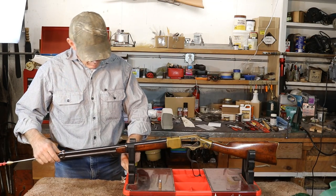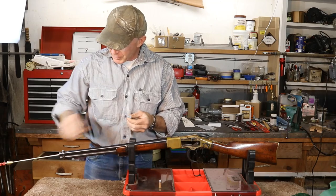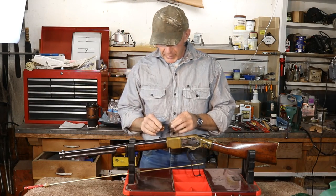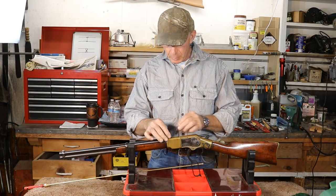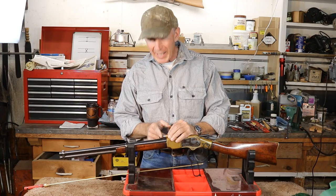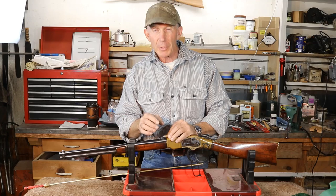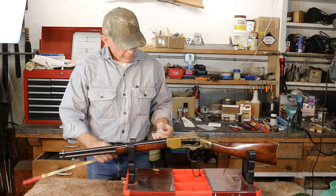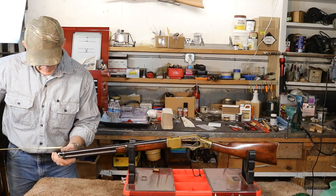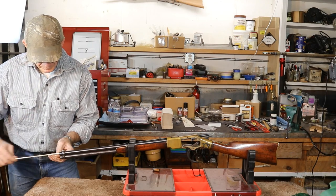Now we've got our plug — in this case I've taken a piece of blue shop towel, and that's going to be the front edge of the plug for our chamber cast. You'll notice there's a piece of tape on my rod; we've already measured it out ahead of time. As we hold a cartridge up above the barrel where it's going to sit in the chamber, we want to get that plug out in front of that cartridge just a little ways — right about the back end of the rear sight. We want to get far enough through the free-bore area and into the lands and grooves a little bit to see throat erosion. We'll run this plug into the bore up to where we've got our tape on the cleaning rod.